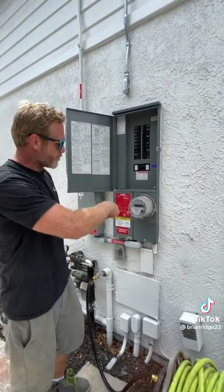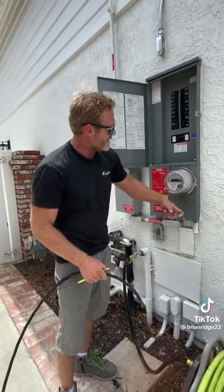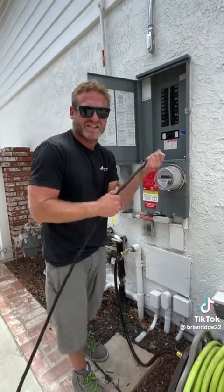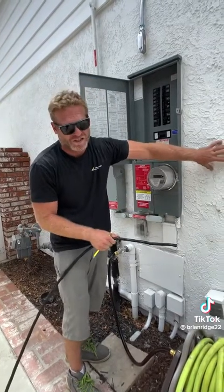I'm going to remove the covers here, here, and here, and I'll probably drill through this stud to run my 6-3 Romex up to the new location for the outlet.